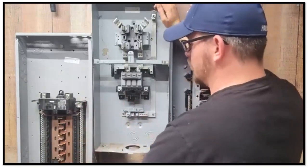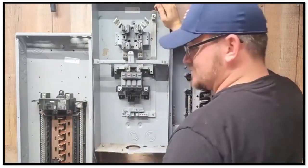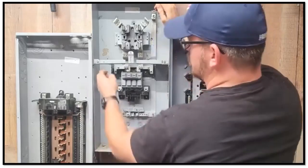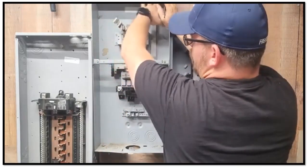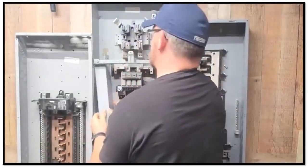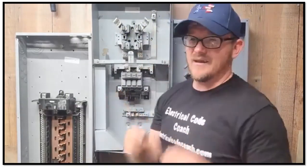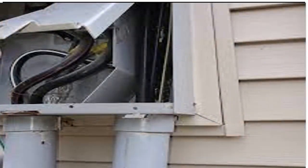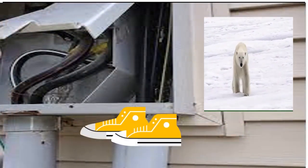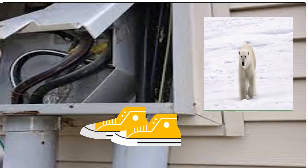You're coming in, rocking and rolling. You have to design your whole outside service based off this one hole right here. And sometimes it can get tricky depending on what you're facing. But you must pop in these holes right here, cleanly whip your conductors up and over, make your terminations, and it takes a minute. But you get this back in there and install your two screws. The number one thing that you can't forget is do not lose this piece — it has a tendency to grow legs and walk away. If you're a pro electrician and you've been in the game for a while, let us know if you've ever lost one or seen one lost on a job. It happens all the time.